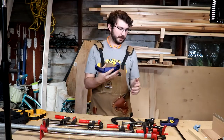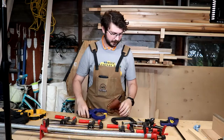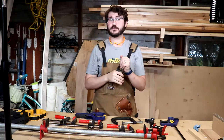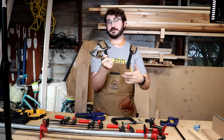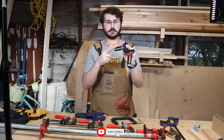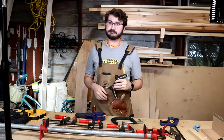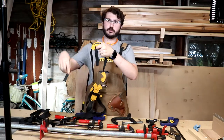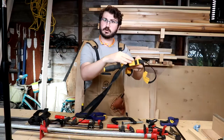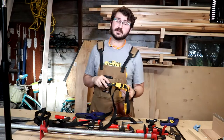There's also a long-reach quick grip clamp — useful but used rarely in my shop. Spring clamps are 99 cents at the big box store; they're great, you can use them one-handed, and I recommend getting a ton — buy five at a time. A corner clamp has two spinning screws that push pieces in and clamp boards at a 90-degree angle. The last clamp I have is a band clamp: each corner piece attaches to a corner of a box, you tighten the rope taut, putting even pressure on each corner so you get a nice square box with tight joints.